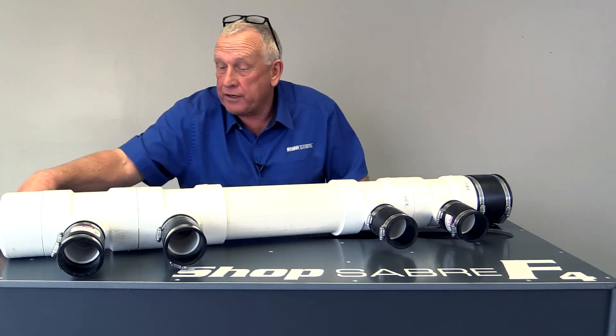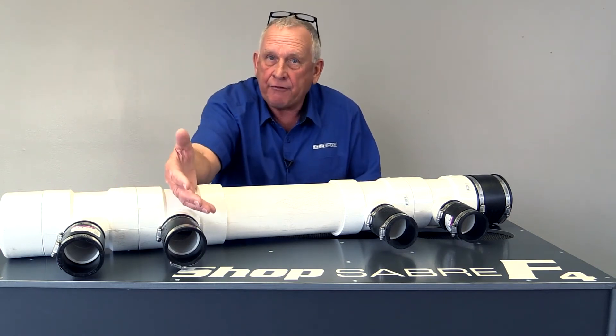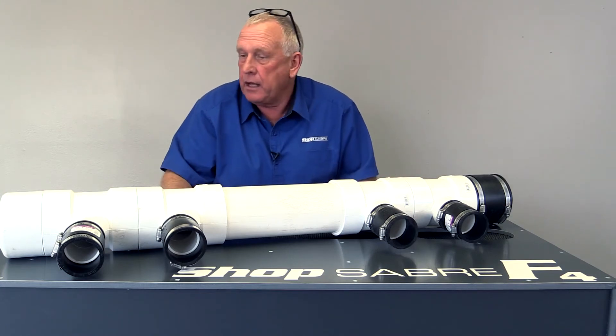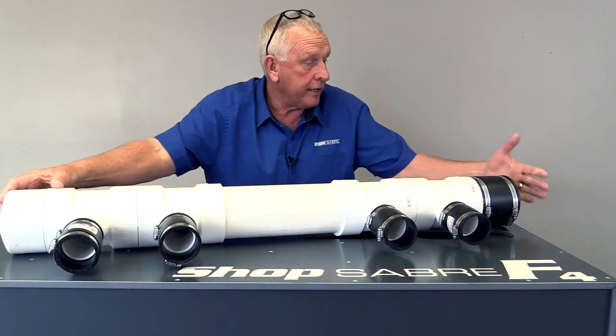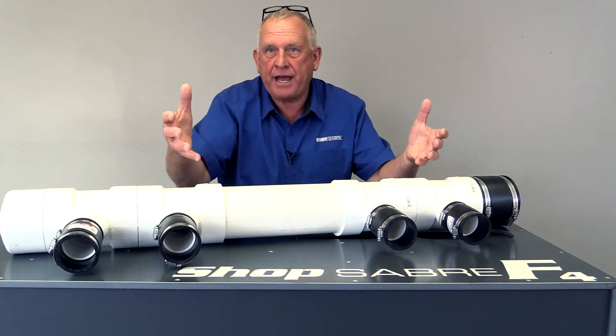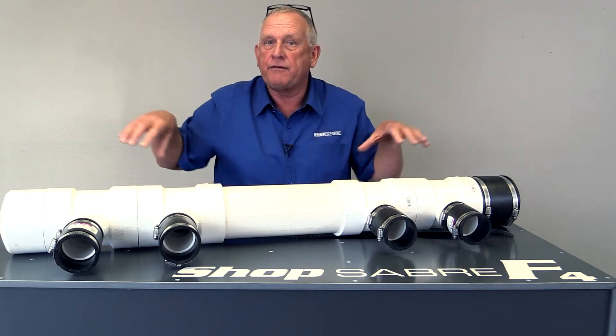What we've also integrated into the cabinet is the filtration system, so you don't really have to have an inline filter ahead of time — which is really a vacuum robber. This manifold then connects with a four-inch tube, and this goes all the way up to the main vacuum manifold on the front of the machine, where it gets distributed out to the vacuum table.